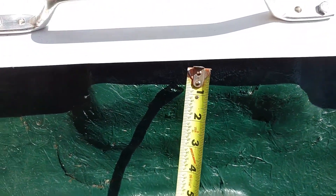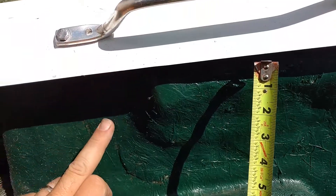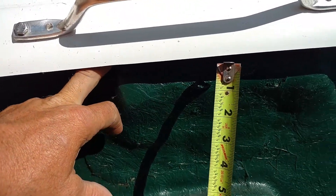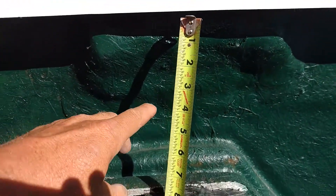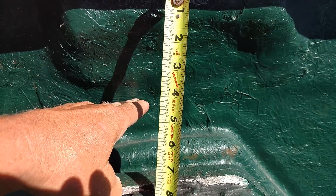As you can see, the other vent back here — that dirt level would need to come in about the same place, about five inches lower than the bottom edge of this door. Whenever you're doing your backfill, whenever you're doing your finished grade, it's got to be about five inches. If you put that dirt too high, it's going to allow water to run up this way and into that ventilation system.